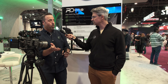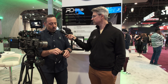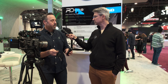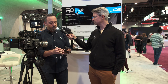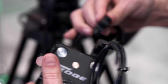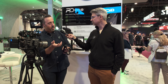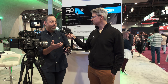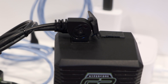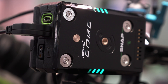You can rotate it around so there's no polarity concern, and it gives you wide range voltage — anywhere from 5 volts up to 48 volts on the platform. With our current battery system, you get up to 28 volts. The real beauty is it eliminates the SDI concerns on cameras burning out, because once the voltage is negotiated, it's simultaneously connected. On current battery packs, we recess the positive pin to protect against it, but it still happens occasionally when they don't disconnect properly.